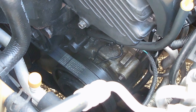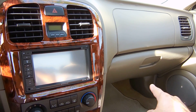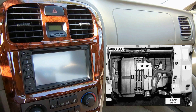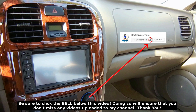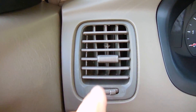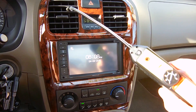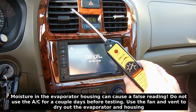Now let's go inside the vehicle to inspect the evaporator. The best way is to get underneath the dashboard on the passenger side or behind the glove box to access the evaporator housing. In that housing you'll see a small component known as a resistor. Since Freon is heavier than air, you can remove the blower module and place the probe immediately in that opening — any detection means the evaporator is leaking. Another method: let the vehicle sit for 10 minutes to overnight, then close all air vents except the center one set to upper level only. Insert the detection probe inside the vent and turn on the blower motor to a medium setting. Any detection indicates an evaporator leak.